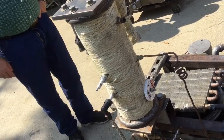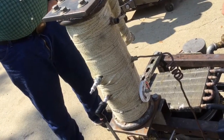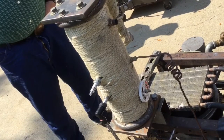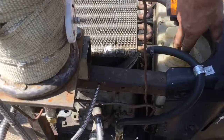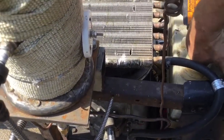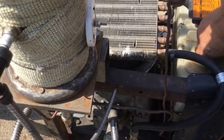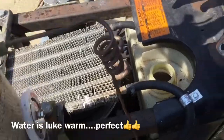You've got pH 10 feed water in there. This isn't going to rust for six months until the air works on the pH. In about six months the pH will go down to eight — it'll still be caustic, still be above seven, which is neutral. Wash your hands because that's high pH, that's caustic water.